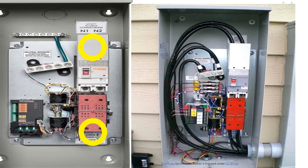Your next set of connections will be going back into the customer's home. With a transfer switch, all you're doing is interrupting the line coming from the meter going to the house panel. There are two sets of lugs — you'll remove that clip and the red piece to expose them. The ones closer to the back of the can are the customer load, meaning the wires that feed your indoor panel.